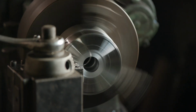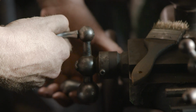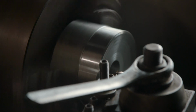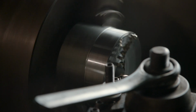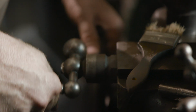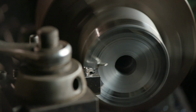I'm going to cut into the face here. I've bored a 1-inch hole through. That's really just so that I have a tang area to come through and then meet the handle. Once I've made that cut, I can come back to the outside and I'll be cutting that V shape that causes the flange and actually takes a huge amount of weight out of this piece. And that'll be the final section that I need. Then I've got all the pieces I can stack up through to create this sword.